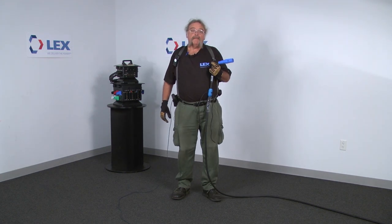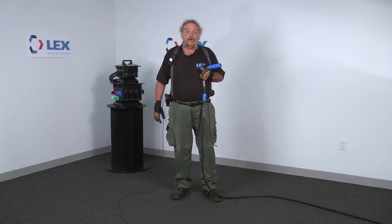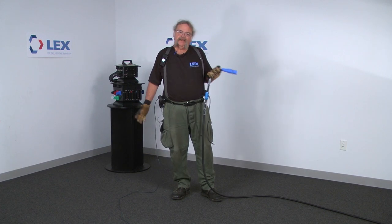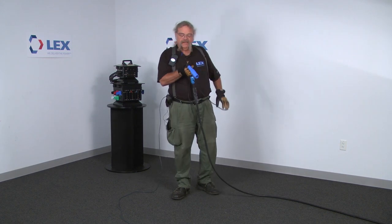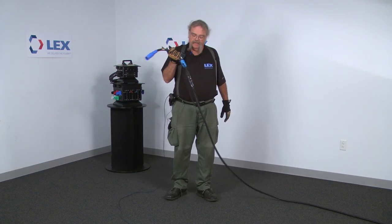Always make sure that the feeder cable is de-energized. If you can, start with the male end, because that way you know it doesn't have power on it and you won't find the power if the insulation is broken.